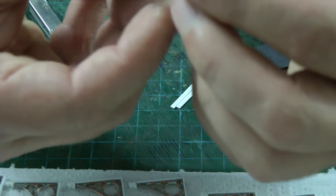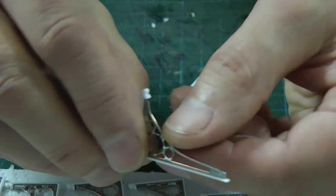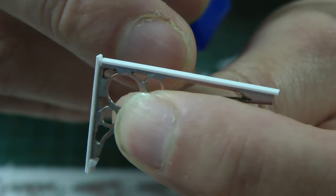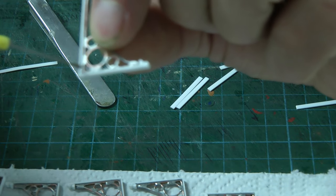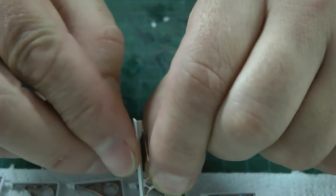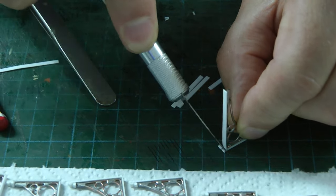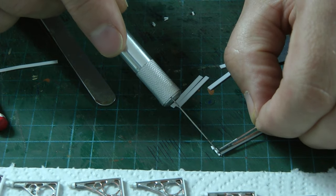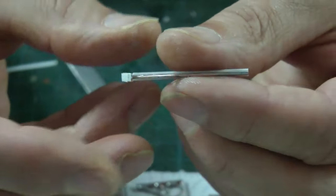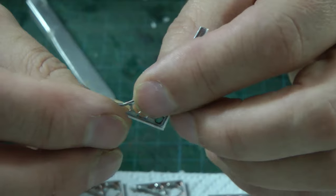And what we'll do then, to make sure it's got it, all the while making sure your support is in the middle of this plastic strip. And because you've got a round corner in that bracket there, right in the corner, we can fill that with contact adhesive. And then we can trim that bit off there. Get that square, and then we do the same with the front piece, cut that off, and then there we go. One support with its half frame or its right angle frame on. So that, once it's dry, is ready for painting.